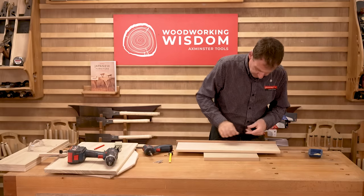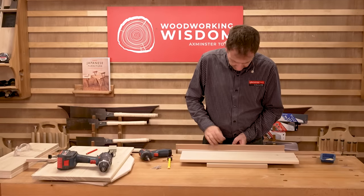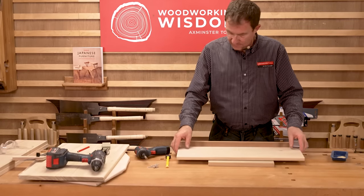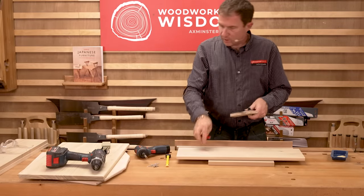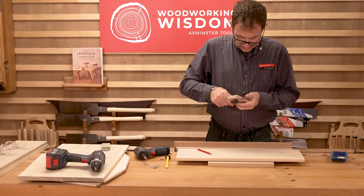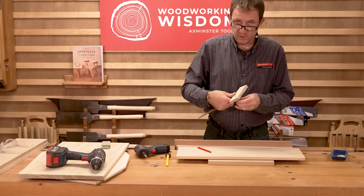All right, so you can see how we're laying things out now. This gives me something to work up against. I've got to be careful how much I pull it about. The MDF will flex a little bit, which is quite amazing. All right, so I've got to make sure, try and push that forward. Get to the next thing I want to look at. We need half of the measurement of the board to mark this out. I can mark it whilst we're in there. I'm going to play with my quick square setup. We've got 18, we want 9mm.